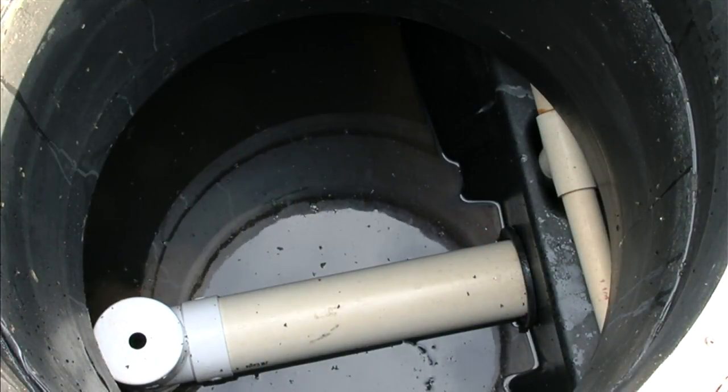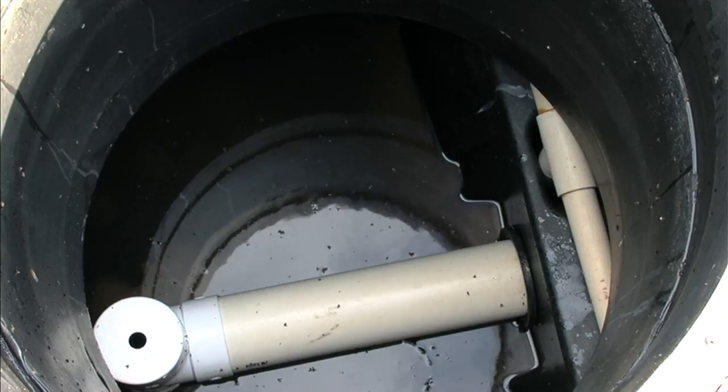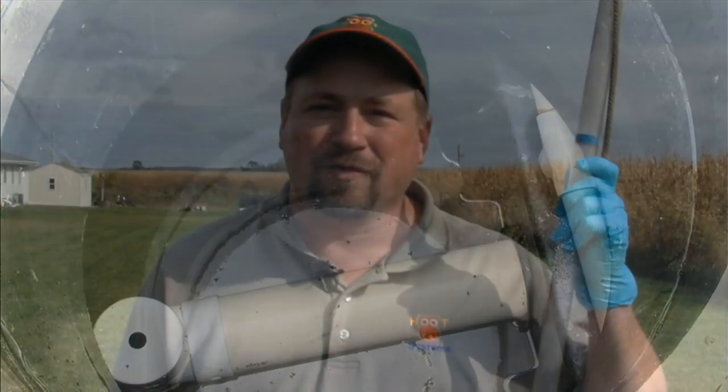This view gives us a good shot of the top surface of the clarifier. You can see a nice clean reflection on the water. The four-inch pipe is the transfer pipe where it leaves the clarifier and goes to the pump tank. You can also see the airline going to the other diffusers running around the top of the tank. From this same location we would also sample for dissolved oxygen with either a sonde, a meter, or using a snap kit.